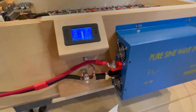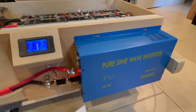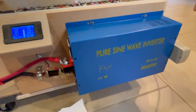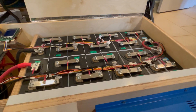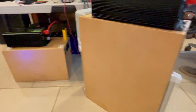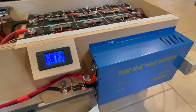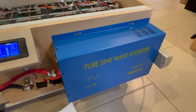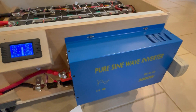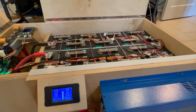The cool thing about this unit is I can pull this Anderson connector and lift it off in a few seconds and move it from one box to the other. While it's on there, it gives me the ability to draw 3000 watts from this 14.4 kilowatt-hour battery pack. Just like with the solar generator and its booster pack, the flexibility to have those as separable items gives me a lot of flexibility — I can take this battery pack and separate it from the system at any point and use this inverter to either supply power in a remote location or use it for testing the battery pack when I'm working on it.